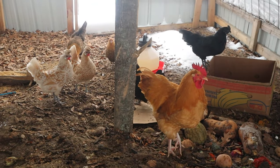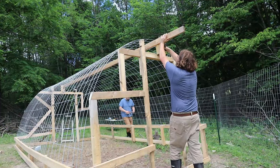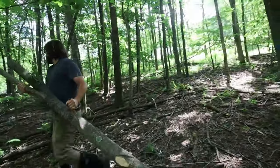We got a couple weeks of temperature readings before the geese started tearing holes and skewing our data. During the hottest part of the day when it was 70 or 80 outside, this thing would get well over 100 — we had readings in the 120s, close to 130 even. At night when it was freezing, it would still get down to freezing, so it didn't hold its heat very well. That could be due to door framing or leaving the door open with chickens running through. As far as handling snow, I have no complaints. I was hesitant to build with cattle panels up here given our winters and how much snow we get, and I've seen videos of them collapsing, but my brother and I made sure we have a ridge beam with a support post in the ground, and it's had no issues handling the snow load.